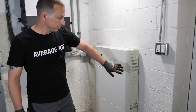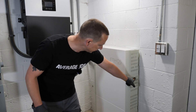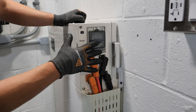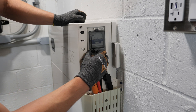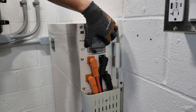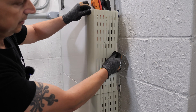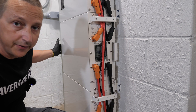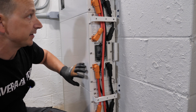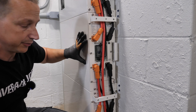Next I'm going to pull off all the side covers — the top one just pops right off, and the two below have a Phillips head screw holding them on. Behind one cover is our main circuit breaker, so we turn the thumb screw, pull down on the little tab to open it, and shut that off. I'm also pulling off the other side to access the DIP switches so we can reassign addresses for the two existing batteries, since the new top battery will be number one — so they'll be one, two, and three.